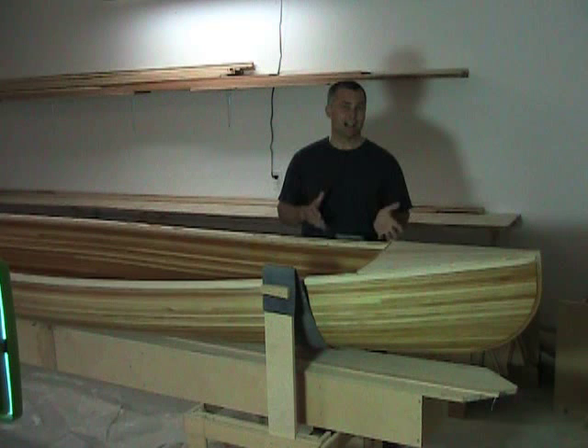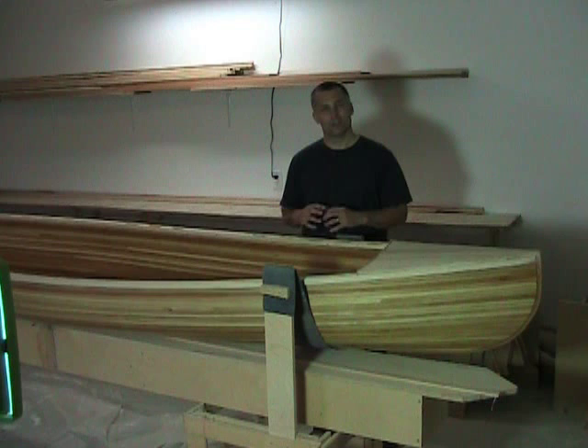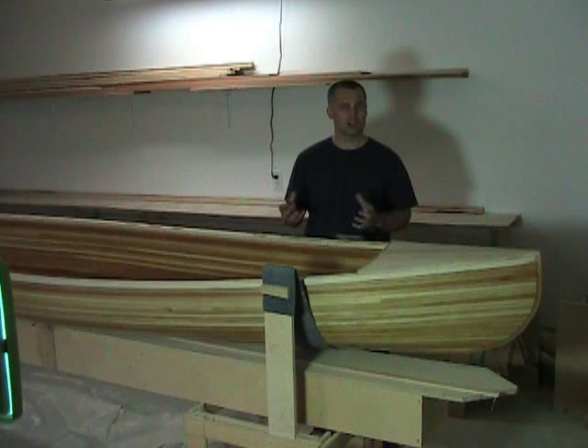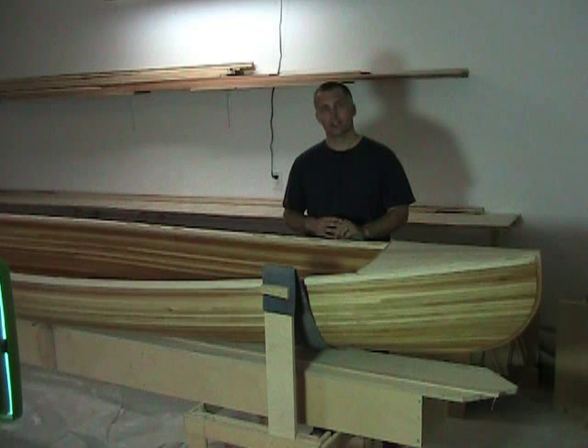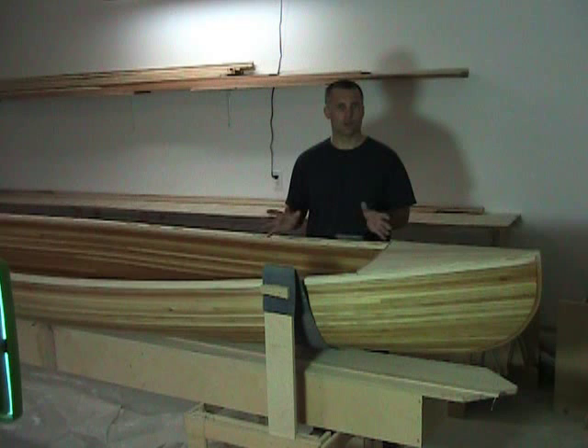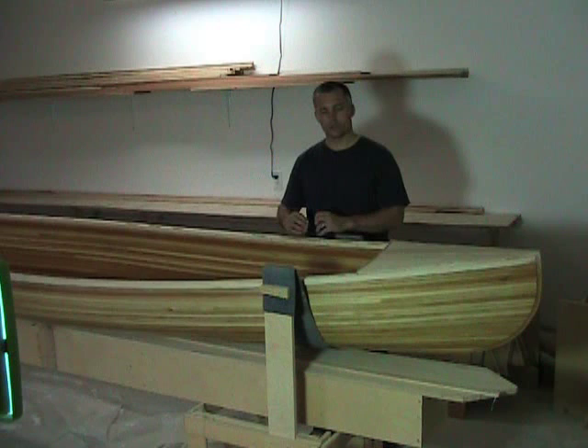The last step I did was take a dampened sponge and wet all the hardwood down. Wetting it down — not to the point where the wood is soaking — just enough to bring out almost like a finish that brightens the wood and causes all the fibers to stand up. I let the wood sit overnight, and the next day the fibers were still standing up but the wood had dried out. This brings out any cross scratches from sanding and all the loose fibers.